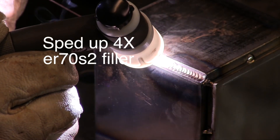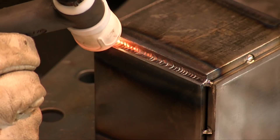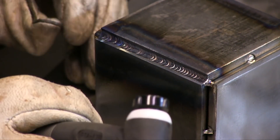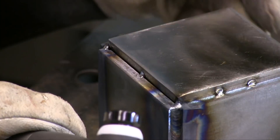Here I'm using a smaller diameter ER70 rod, and it's putting quite a bit of heat in there. But that's not because of the rod — it's because I got in a hurry. I didn't stop and let it cool, so the piece was already really hot. That makes a big difference on discoloration and the size of your heat affected zone.